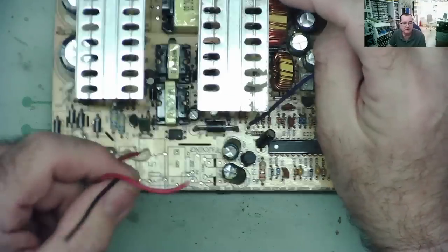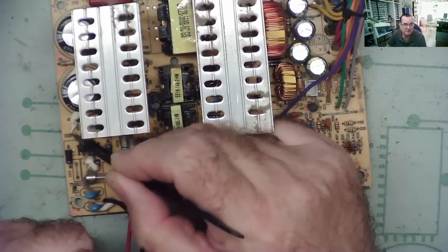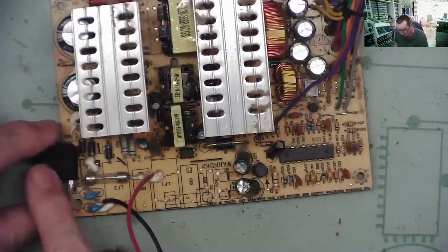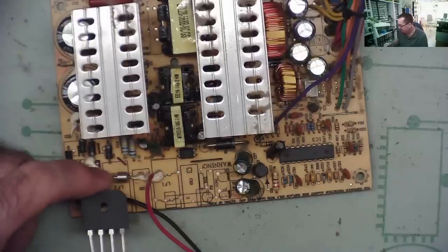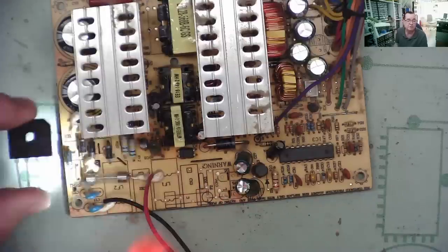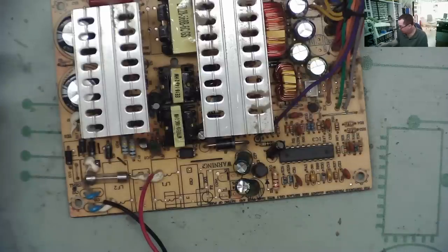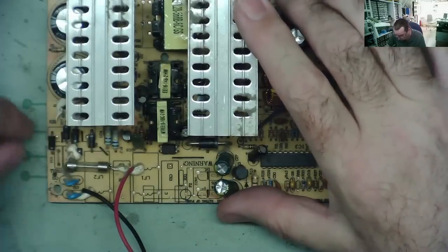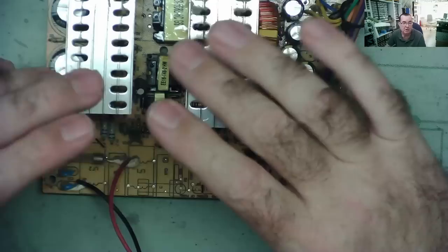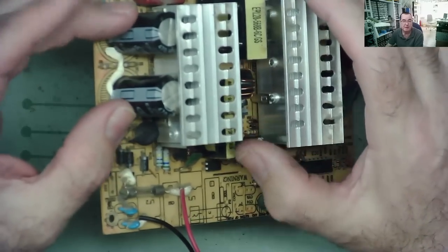So what we have here is the mains voltage coming in, which goes to a fuse, to a bridge rectifier. This bridge rectifier is made up of four individual diodes, but it could also be an encapsulated bridge rectifier. Inside it's literally four diodes - marked AC input on the two middle pins, then plus and minus. They're just doing what one of these has inside it but using separate diodes. You'll find both types on power supplies. All we really need to know is that this takes the AC input and gives a DC output - but it's not a constant DC, it's pulsed DC. These capacitors then convert that into a smooth DC voltage of about 320 volts.